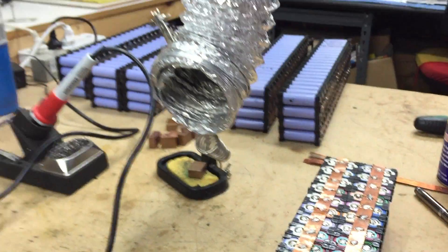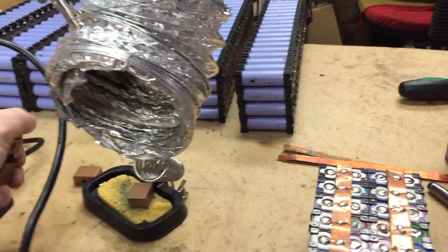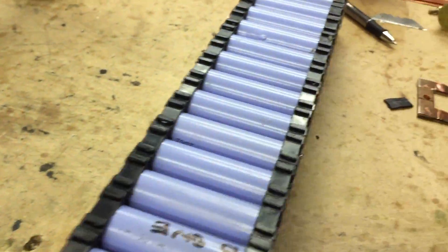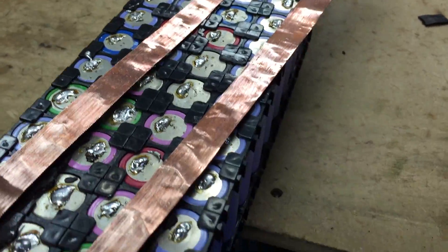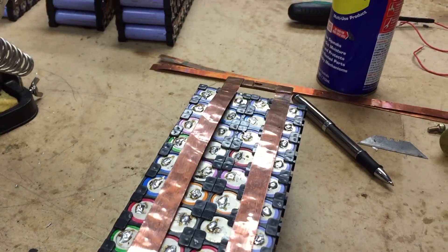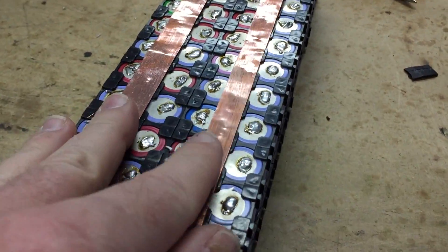G'day tubers. I've just pulled the third pack. This is the one with all the bus bars along the top and none along the bottom, so I'm about to change that. Got all the spaces cut and drilled. I've just pulled apart this pack — stripped off one side, pulled off the bus bar. I want to reuse these, I don't want to throw them away. The new way I'm having it means I can still reuse the bus bar. I'll clean it all up a bit more. I've re-soldered the joints up here so they're much stronger — we're not wasting anything.